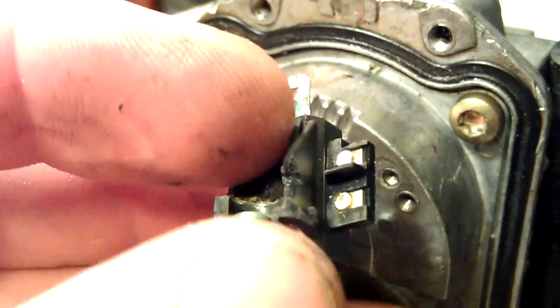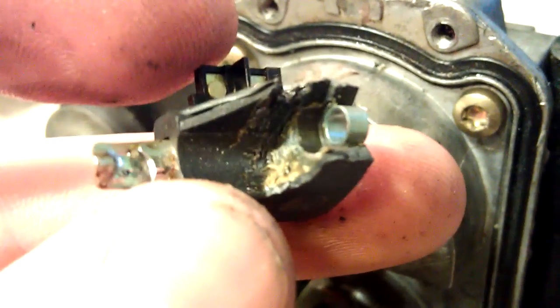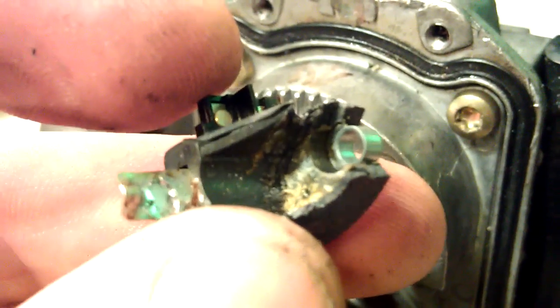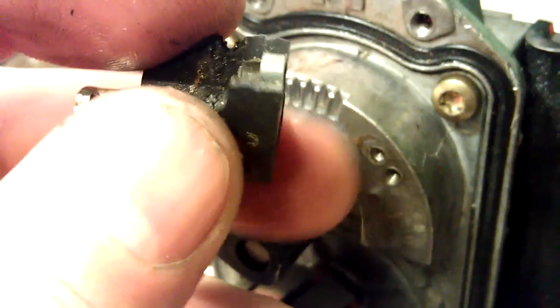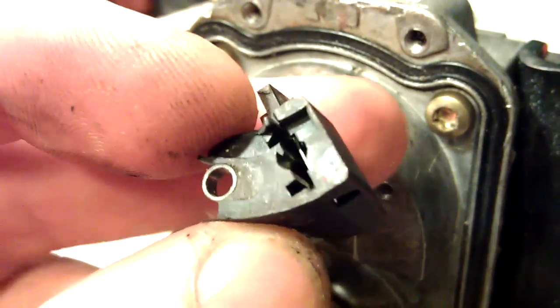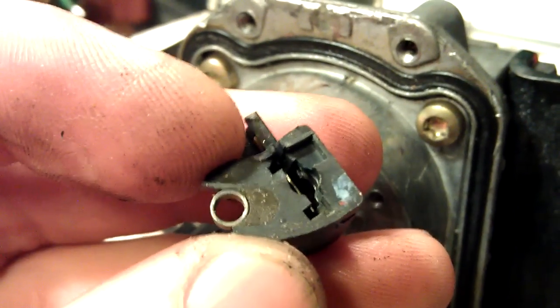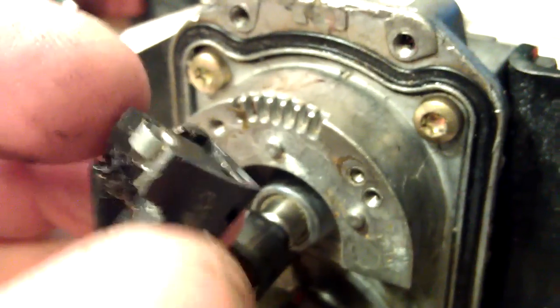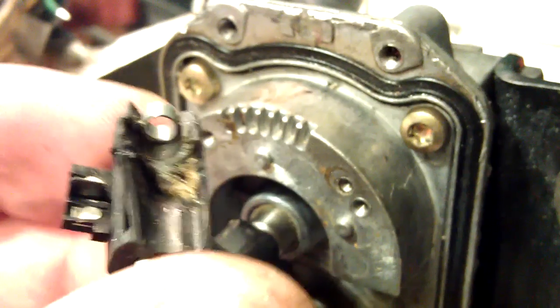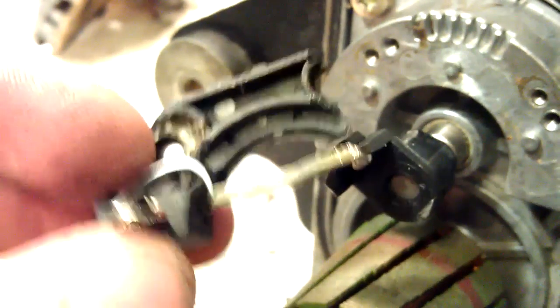The other part broke, which I'm going to have to epoxy together. This is some sort of old-school epoxy — that brown stuff — which is extremely strong. I cannot totally remove it, so I'll have to alter the actual contacts rather than taking the material out completely and moving the micro switch around its position. I don't want to do that because removing this material might cause more problems keeping everything synchronized.